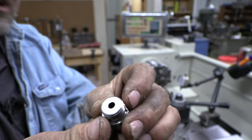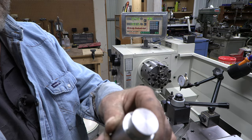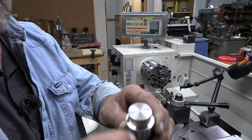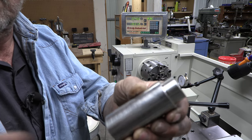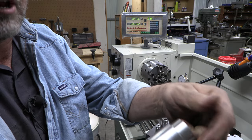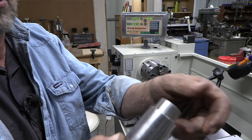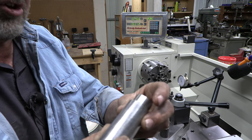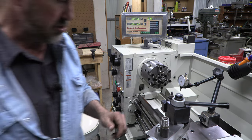I also cut threads on a barrel cutoff I had saved, and it threaded and faced real nice. Then I grabbed a chunk of surgical stainless — non-magnetic — and did about a quarter-inch cut in two passes just to get a feel for the machine and see the finish. It came out a mirror finish. I rubbed my hands over it and it dulled up from the oil in my fingers, but it did a real nice job on a facing cut. So far I'm very happy — I've done a little more precise turning and it's been a really good machine.